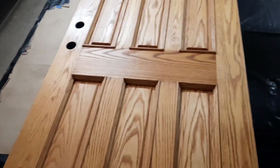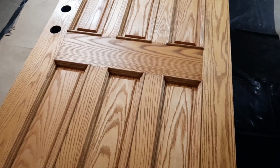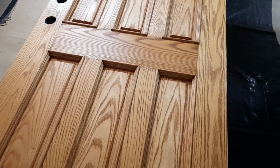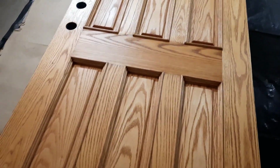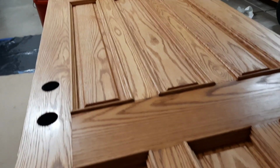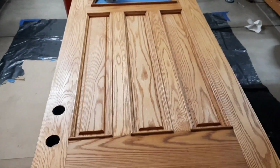Ultimately, the bubbles were not really an issue. They tend to go away on their own. One thing I learned is the foam brush does a much better job of spreading on flat surfaces, and the slower you go with a smooth stroke, it lays down a perfect coat. So let's see if we can get a little reflection in the light. Parts of it are still drying and getting absorbed. So overall, looks really good, and we'll keep going.